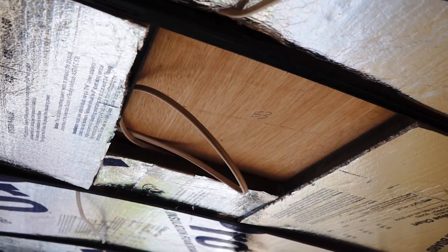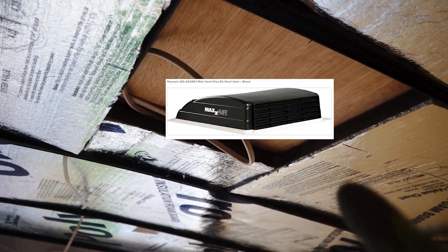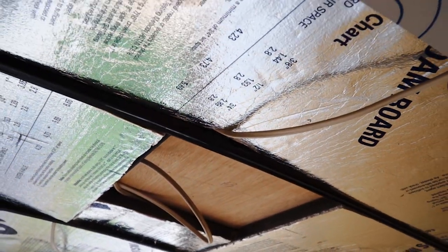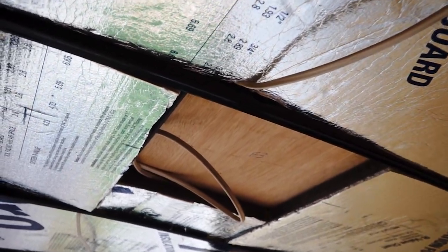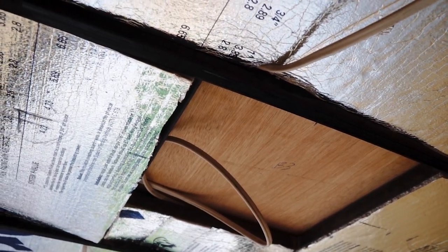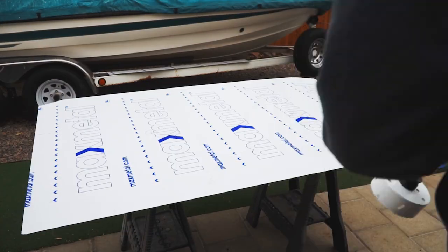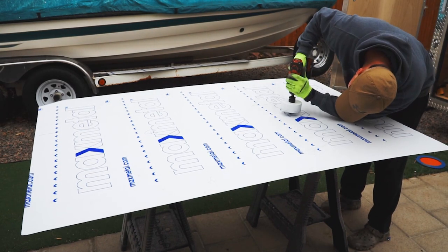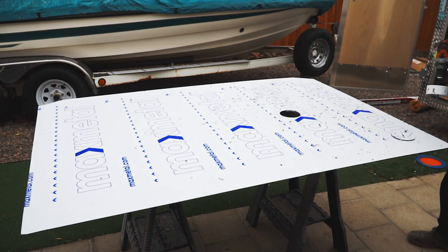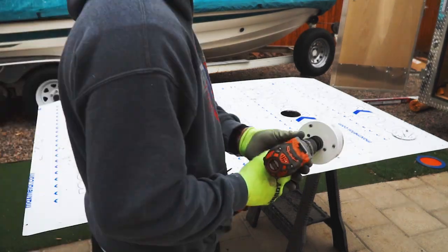I also had my exhaust fan delivered, so I'll be doing that next. I'm going to install this first panel and then cut out the opening for it that way we've got everything ready to go. I don't want to put a hole in the ceiling until I have everything I need — I'm still waiting on the roof sealant. I measured out the placement of my ceiling lights and then came in and pre-drilled my holes with a four and a quarter inch hole saw bit for my four inch recessed lights.